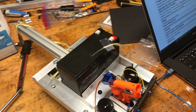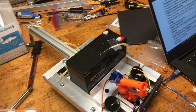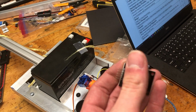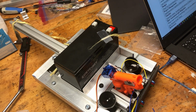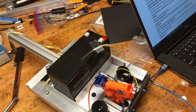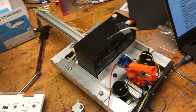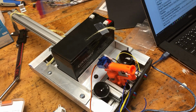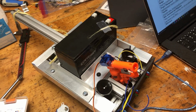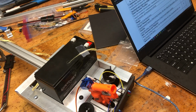And yeah, we're just going to fight the other robot by moving the car around. So the code for the joystick is not super complicated. It's just 2 potentiometers, so 2 analog inputs. But we're going to ideally have another Arduino off this car that we're going to upload the signals from these analog signals to, and then transmit them over Bluetooth to this car. So we're going to have a Bluetooth, or the module that we were given.